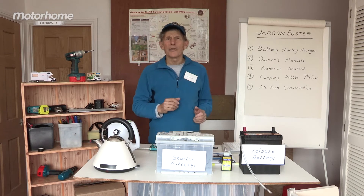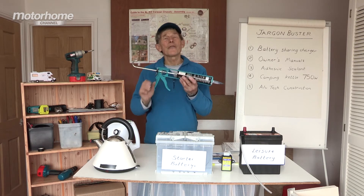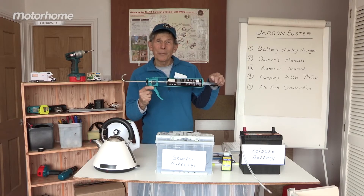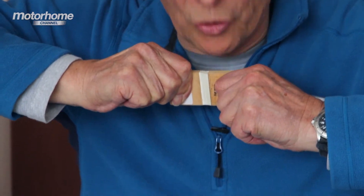What's adhesive sealant? Not the sealant around your bath at home — that's ordinary sealant. Not the stuff around the wash basin. This is adhesive sealant and it is an adhesive as well as sealing. It's black, this one as it happens. Here it is in white form, and as long as it's more than three millimeters thick, my word it's strong.